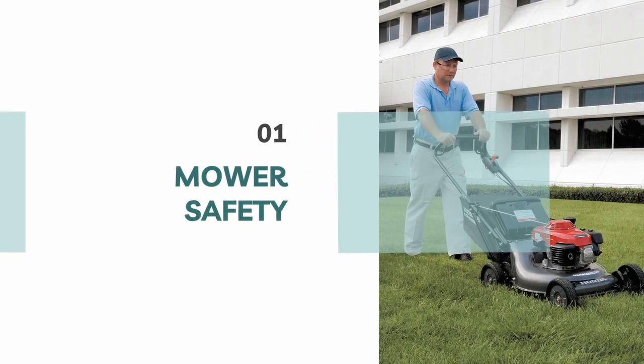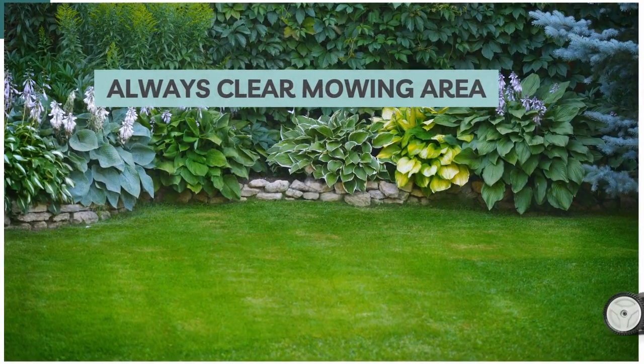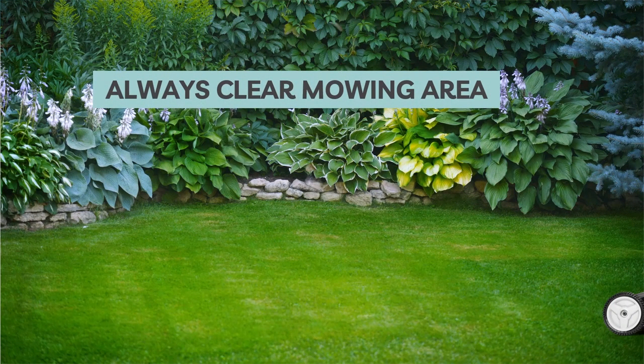The first section of this video manual is mower safety. Most accidents with walk-behind mowers can be prevented if you follow all instructions in this manual. Rotating blade accidents can cause serious cuts and can even amputate your fingers, hands, toes, or feet. This can be prevented if you keep a safe distance between yourself and the machine whenever the engine is running. Rotating blades in the mower can throw rocks and other solid objects with enough force to injure someone in the area. To avoid these accidents, carefully inspect the mowing area and remove stones, sticks, and other debris that can go inside the mower.